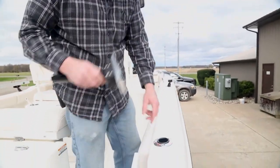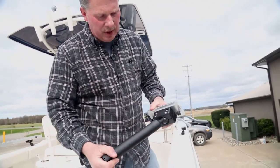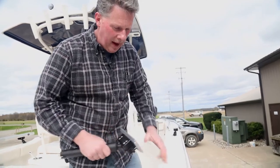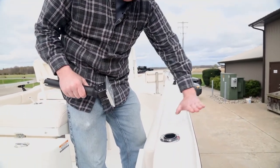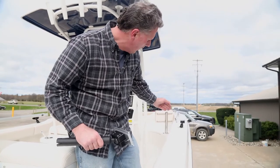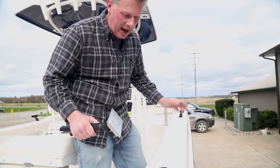The unique thing about our adjustable gimbal with our ball design is that it's able to pivot and rotate around and match up to any angle that the flush mount has — most of which are standard 30 degree, 15, or 90s. But there's an inconsistency when building fiberglass walls, where the fiberglass is tapered in or tapered out or the two of them don't line up together. The front gimbals are always mounted out at an angle, 30 to 45 degrees, but never on an exact angle.